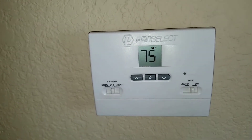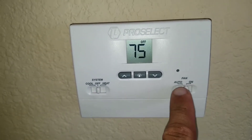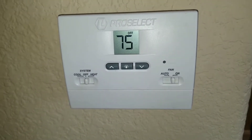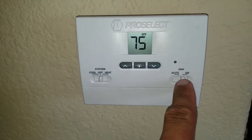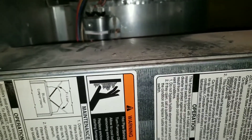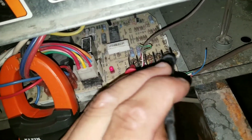When you turn your thermostat to the on position, you're basically just running it as a regular fan, continuously recirculating the ambient air in the home. When you put your thermostat to auto cool, that's when it will act as a thermostat regulating the temperature inside — that's what will kick the AC on and off. If you put your thermostat to the on position, you're simply running the fan. You can see my fan motor is running, and I'm going to tap the common lead and my green lead — I should get a reading of 24 volts.